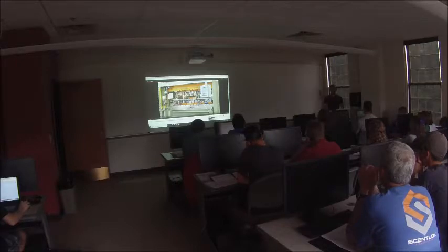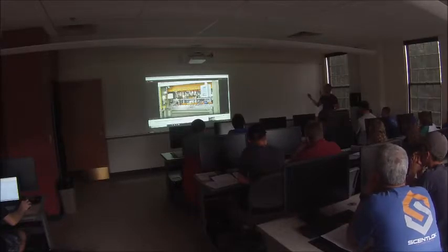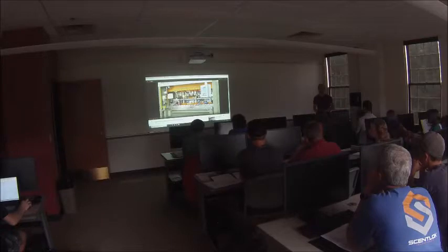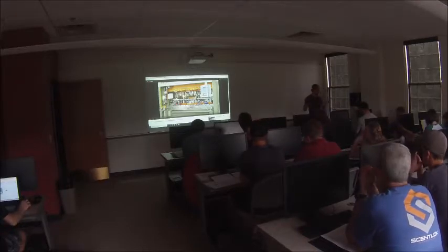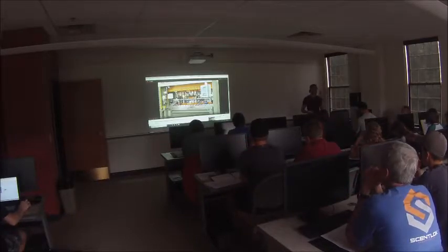Typically the brake is hydraulically actuated, and it can be manual, where you just have a lever or a button and run it down until you like it. That's what this is called, a press brake. It's one particular type of brake. Most press brakes are CNC, where they automatically come down and go the right distance to bend your material. As this punch comes down, it forces the material in and bends it, which makes a nice consistent bend. It doesn't have to push the material all the way to the bottom of the die to bend it. That's a key thing. We use a CNC press brake in addition to our laser to make most of the structural parts of our robot.